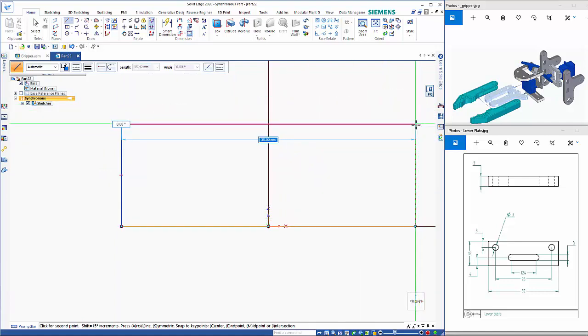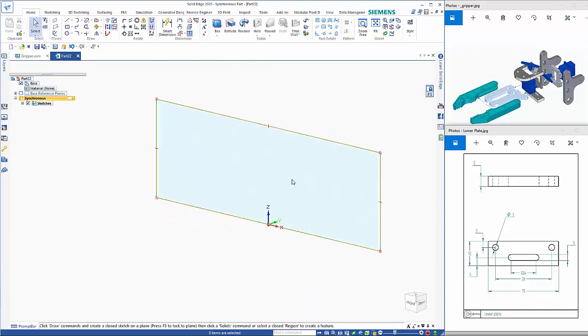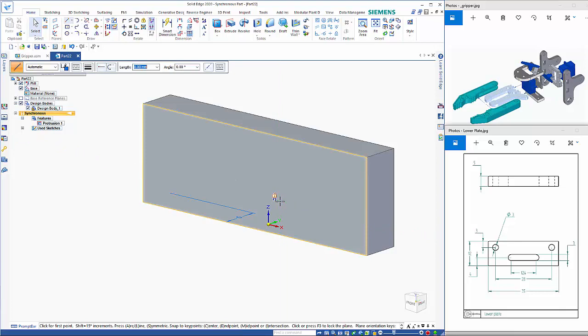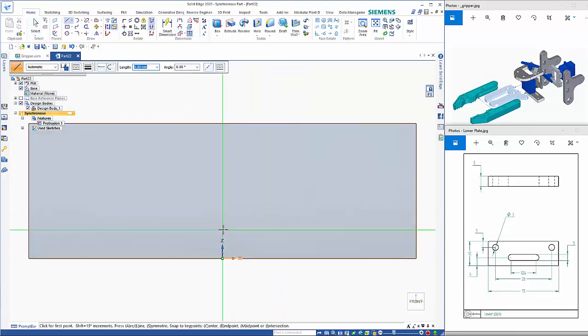Make sure I pick up off that endpoint, and I can place that down in there. So for the thickness, it is 5 mil, so click within the region, and we want this to be symmetric, so that's good. And then for the slot, I'm going to draw the center line of the slot, so F3, Control H again, S for symmetric, and this is 12.4 long.